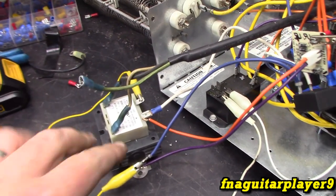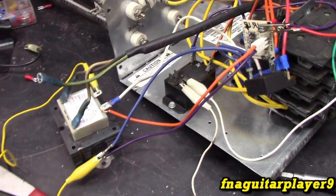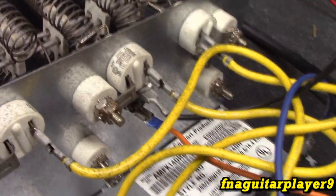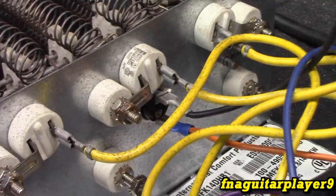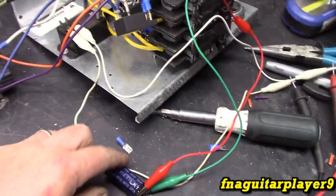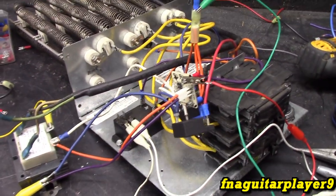So it'll work, a little kind of a crude way of doing it, but this is a DC setup. The thermostat's still seeing AC voltage. This will be representing the thermostat here, coming off the transformer at 24 volts. I'm also wiring up the safety feature, which is the thermostat shutoff here in case something gets too hot. That'll break the ground on all three coils and will also bypass the capacitor. So if anything happens at all, it'll shut everything off immediately.